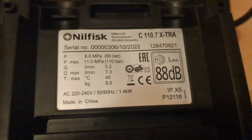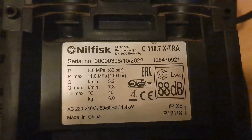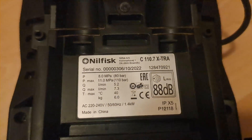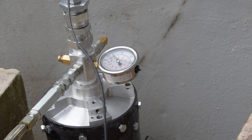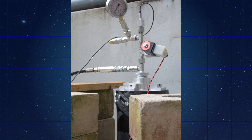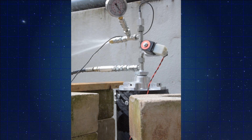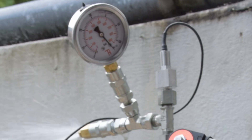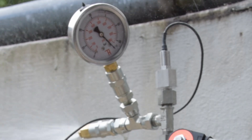The method we use for pressure testing is a pressure washer. Pressure washers are designed to operate at pressures up to around 100 bar, so going up to 60 bar is within its capability. As you can see, the combustion chamber casing performed quite nicely — it was able to hold 60 bar for much longer than the eight-second full duration burn we'll have at propulsion testing. So we can be confident this part is ready for propulsion testing.